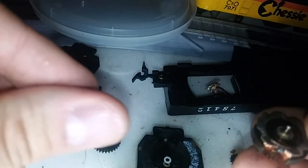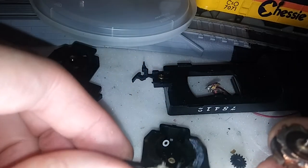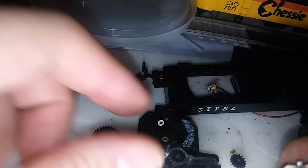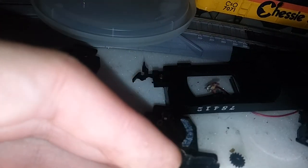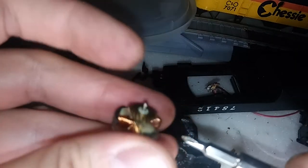And here's part of the commutator that has been sheared off. See this little piece here? There was a piece of metal that should have been there and it's not there anymore. It looks like this melted, actually. So the commutator on this motor is literally melted to a certain extent. There's corrosion on it and you can see where it burned. You can also see the corrosion that piled up on one side from all what happened inside. This thing really has been trashed — utterly and thoroughly. This is what's left of the grease which somehow got piled onto this side. It looks like it's what saved it from burning up completely.